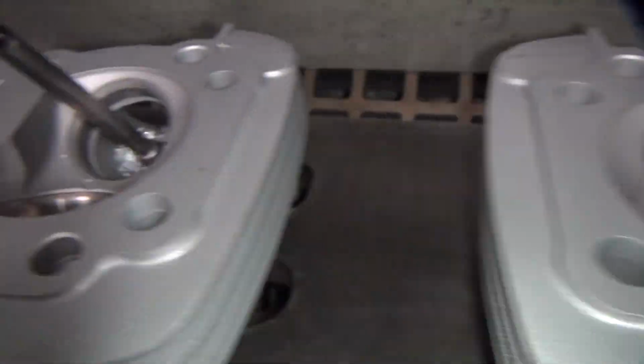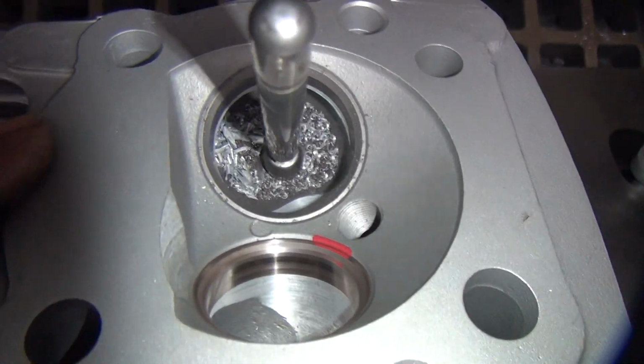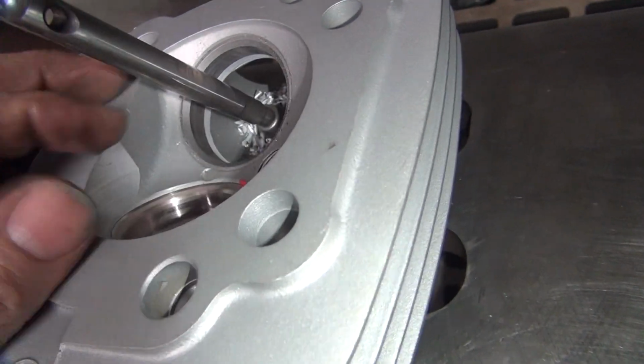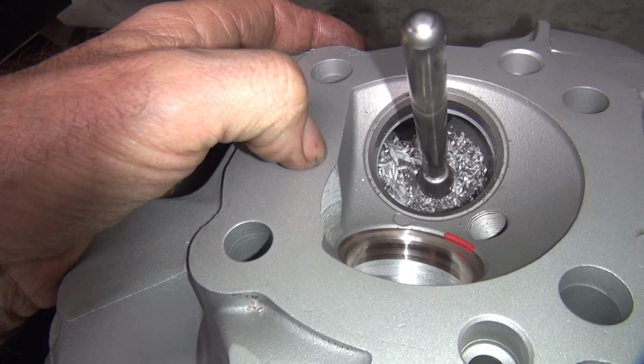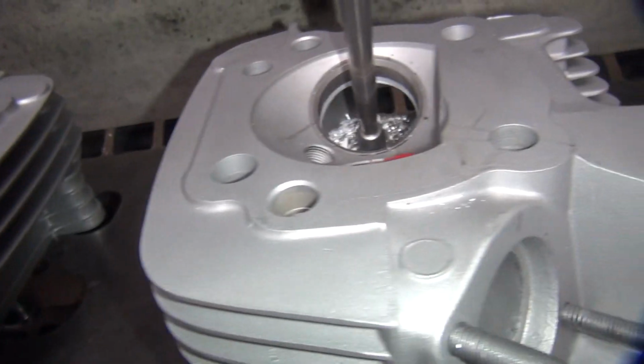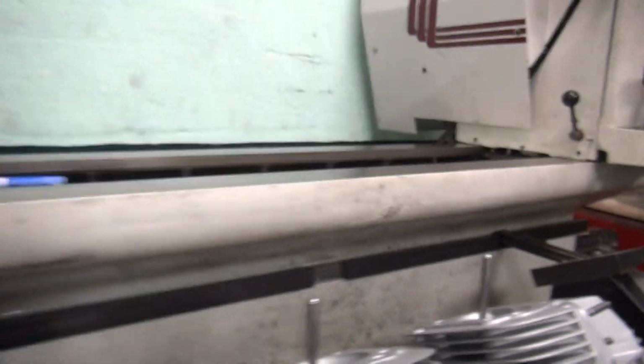So you got a nice deep opened up bowl now. So now we get some airflow on the outside. So we'll do our valve job and we'll blow this corner out here. Let it breathe around the valve to port. So that's the next thing to do.